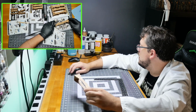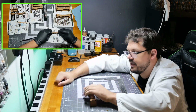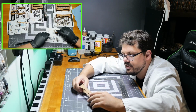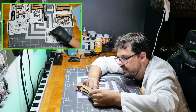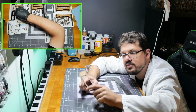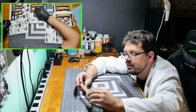And then after I put them together, before I straightened them up, I should have gone over this first. I took a bit of shop towel, you could use paper towel I guess, and wiped off all the edges, and I took a little toothpick that I was using to apply the epoxy and put a bit on the end, and I made sure to clean up the inside corners because I didn't want any bumps in here, because I wanted these perfectly clean to perfectly fit the foam inside.